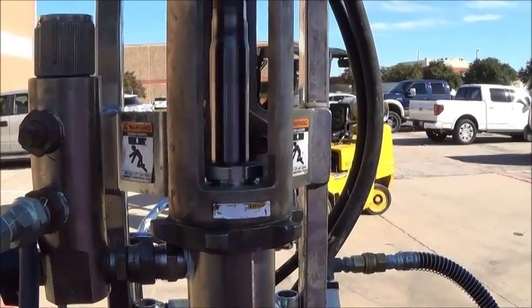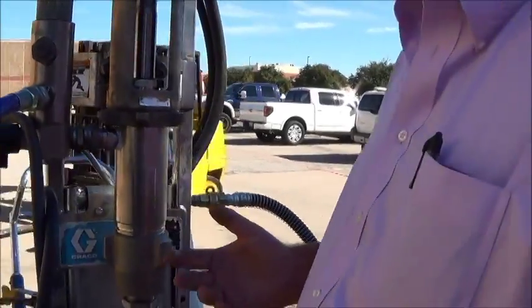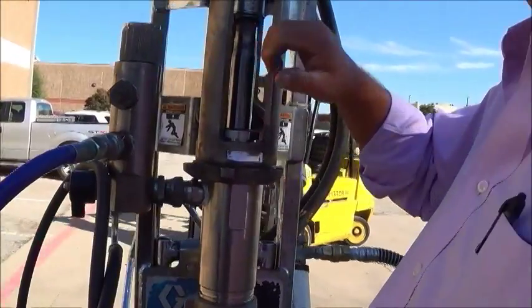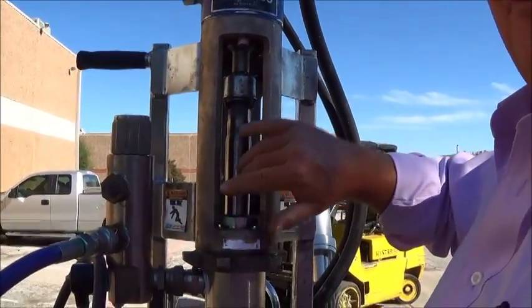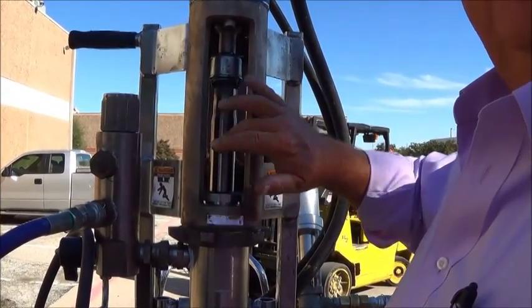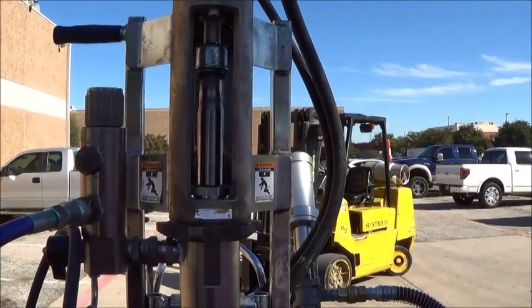And what was the oil they needed for that? It's called TSL, throat seal liquid. It's not a packing lubricant, it just protects the packings and it coats this rod. Because any overspray is like liquid sandpaper, and that's what tears your packings completely out.